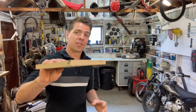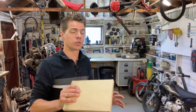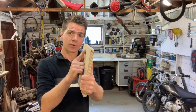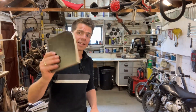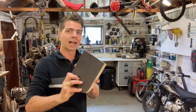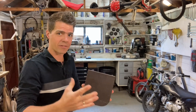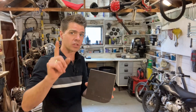To build this body I'm going to be using this 18mm birch plywood. This is certainly not the cheapest plywood you can buy — in fact it's pretty much the most expensive — but it's also the best quality. If you want to cut out curves and radii from the edge, it is ideal because it's hardwood and very densely packed. I'm also going to use this same birch plywood but with a glossy waterproof coating on one side and a hard-wearing waterproof surface on the other, which is great for high-traffic, high-wear areas such as the seat back and the floor panel.